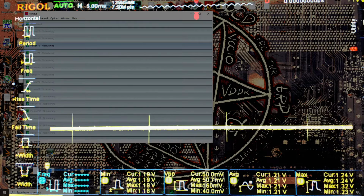Though there are other reasons to not use very aggressive LLC, which we're about to see, because right now the motherboard is running Mode 1 LLC, which is the 0 V-droop setting for this motherboard, at 500 kilohertz switching frequency. The voltage regulation on this LLC setting sucks, regardless of the switching frequency, which is another very interesting thing about this motherboard. It does give you VRM switching frequency settings, but you get the best voltage regulation at 500 kilohertz, interestingly enough.